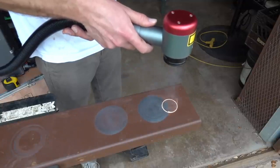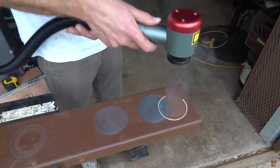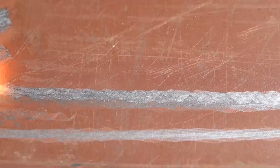This works fine as long as the lens remains clean, but if the surface of the lens gets enough smoke on it, those contaminants on the glass can absorb heat from the laser beam. This can heat up the lens enough to destroy it — glass, after all, doesn't like to be heated unevenly. There are two broad categories of laser cleaners I've seen for sale online: continuous wave lasers and pulse lasers.